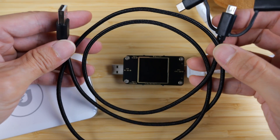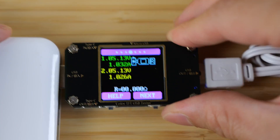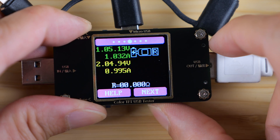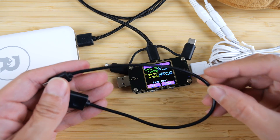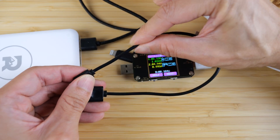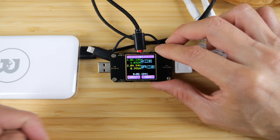I'm going to use this one, which is of a typical length. First we plug it in again — it's drawing about 1 amp. We take a measurement and it goes to the next step, then we unplug it, connect one end of the cable here and the other end into the device. Luckily the current is about the same. The resistance is about 0.18 ohms. Now you might wonder why this shorter cable has a higher resistance than the longer cable. It could be because the wiring is much thinner — I can see this whole cable is a little bit narrower than the other one. Sometimes you have thicker gauge cable and it could actually have a lower resistance even though it's longer.